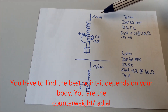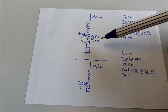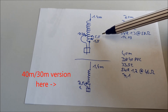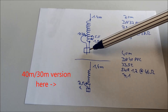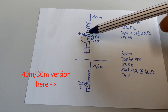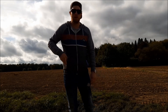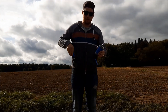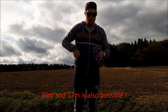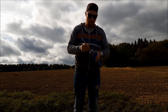This is the 1.4 meter telescopic whip antenna. Here is the coil — the coil is shortened from the bottom side, 1.5 windings to 5.5. And then the inner connector goes to 11.75 windings. That gives you the 20 meter version. Today we want to check those coils for 20 meter and 40 meter with this telescopic whip antenna.